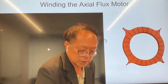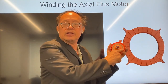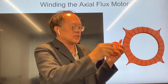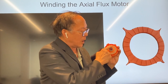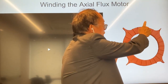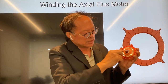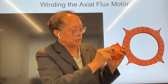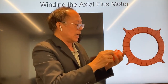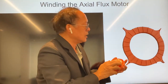I'll explain how to build this stator. There are 16 magnets on this rotor. We have three phases per lambda — one lambda is the distance between two north poles, so north-south-north is one lambda. In terms of the number of slots, you have two magnets (north and south) per lambda and then A, B, C. With 16 magnets placed evenly on a circle, that gives eight pairs of poles. These are round magnets, 1 cm long and 1 cm in diameter, N52 very powerful magnets, which you can buy online.